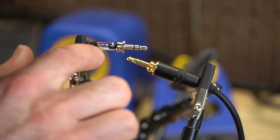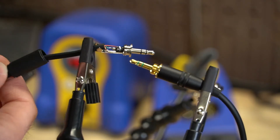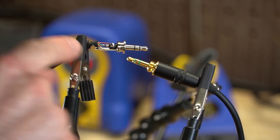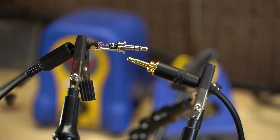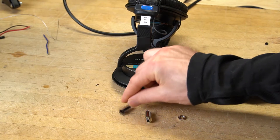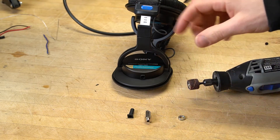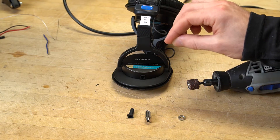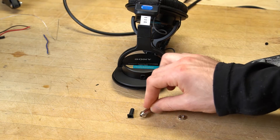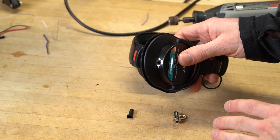The color on the wire comes from the enamel coating, but the copper wire is also coated with enamel — it's just clear, so you still have to burn through it before you can get a proper solder connection. It took a bit of finesse but I was able to solder on the replacement jack. You just have to carefully cut your leads to the right length and always remember the little strain relief piece that comes in the kit — put that on before you do the soldering. Finally you have to bend this little tab to hold on to the cable. There it is removed; I've scarred it up a little but I'll paint it later.